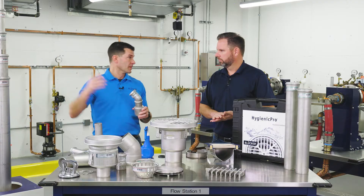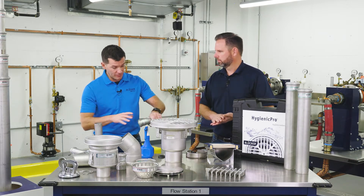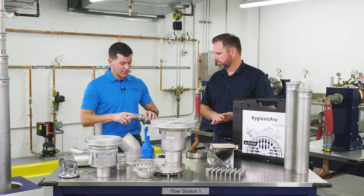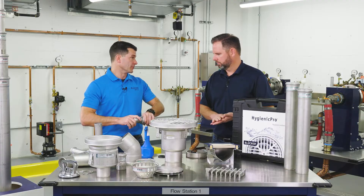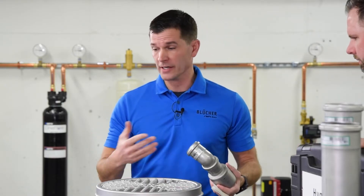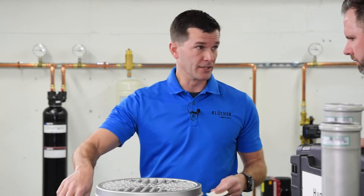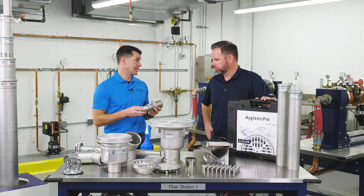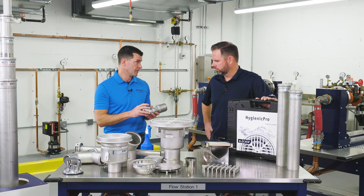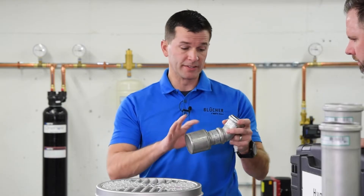It's this simple with all the different pipe lengths — all the way up to 12-inch diameter, all the diameters, one and a half inch. 12-inch gets a little harder than this, but not by much. You can connect it with just one person, right through. Once it dries, it locks into the 7 PSI pressure rating, depending on the size of the pipe. The bigger the pipe, the PSI goes down, but it sits and holds. That's the key from a non-pressurized pipe system or waste drainage system — being able to lock through and follow the flow pattern of the waste, so there's nothing hanging up.